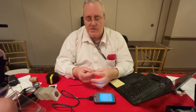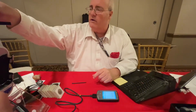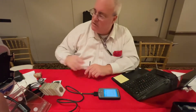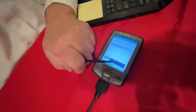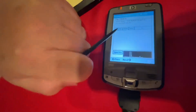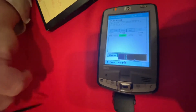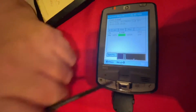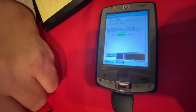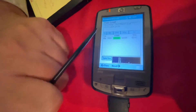Mark Benvenuto again. We are going to analyze by x-ray this half dollar, which is a bicentennial half dollar marked 1776-1976. We are not sure what it's made of but suspect it might be counterfeit. We've put it in the XRF chamber and are now analyzing it. The spectrum has come up and shortly we'll get some readings as the PDA integrates this. Right off the bat, it has a little bit of copper and almost entirely lead. We have two really big peaks as well as a small peak indicative of lead. Having run a bunch of lead objects over the course of years, after a while you get to know where they ought to show up. We'll let this go for 30 seconds.